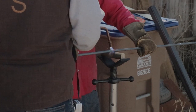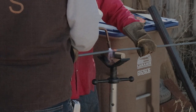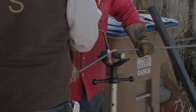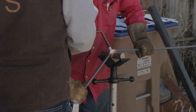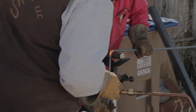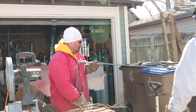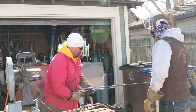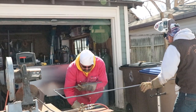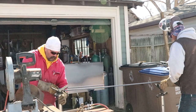You guys can see that we bent the top rack. Now, the thing about bending the top rack, and I cannot give you measurements for the top rack because it's going to depend on what size rod you're using and things like that, but there's a thing called stretch out, and a lot of sheet metal workers are going to know what this is. When you start to bend things, you're actually going to start stretching, and you're going to have to add that stretch out into your measurement. So that's going to be up to you guys if you want to try to bend it or if you just want to cut four chunks of it and weld it together. It's going to look great either way. The bend did look really good. We did make a tie-in weld in the middle of the run. That way we had four corners that looked the same.